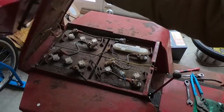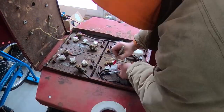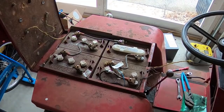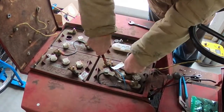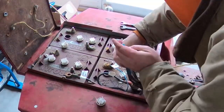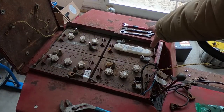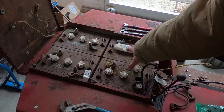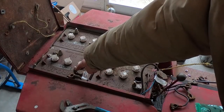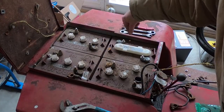Here's the back of the tractor. It's got four 6-volt batteries back here, so I'll have to mark the positive and negative cables and then start pulling those apart. The first thing I'll do is mark the power cables, then start disconnecting the cables connecting the batteries. These batteries are 100% dead and the main power disconnect is off. One little trick here is that these batteries are designed to completely fill up the space, and there are kind of these sheet metal tabs, so you can't pull either battery straight up and the negative cable gets in the way. So you pretty much always want to take this battery out first and put that battery in last just to be able to get the rest of them out.